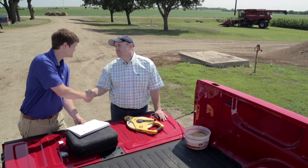Ben, thanks so much for your knowledge — we really appreciate it. Talking with Ben today showed us the value of performing yield monitor calibration at the beginning of the season, whenever there are changes in crop types, and any drastic field or equipment changes. Accurate data is an enormous help in making wise decisions. After all, if you've paid for the technology, you want to get the most you can out of it. This is Jake Turner, reminding you to stay safe out there. See you down the road when you have a minute — an Authority Minute.